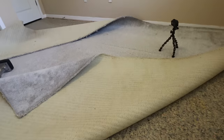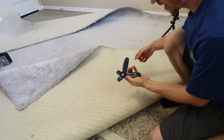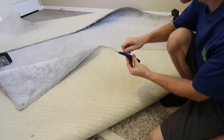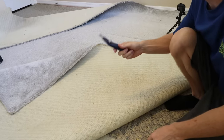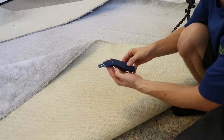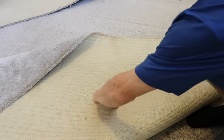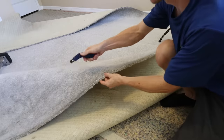One of the most important things in doing this with carpet is having fresh razor blades. A fresh blade is your friend — a dull blade and you will cut yourself. You have to be very, very careful with these tools; they are very, very sharp. If you're going to cut the carpet to get it out and make it easier, cutting on the back and going down the middle will cut it much easier than trying to cut it on the face.